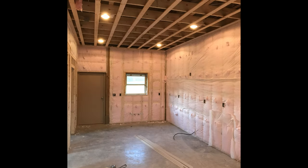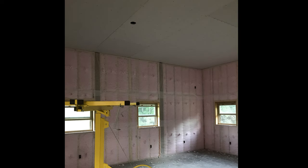With the insulation all in, we can go ahead and drywall the entire inside of the living area. First we used the drywall lift and got all the sheets on the ceiling. If you can get 12-foot sheets, you will have fewer seams to mud.